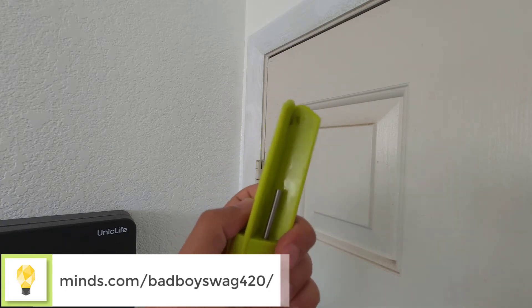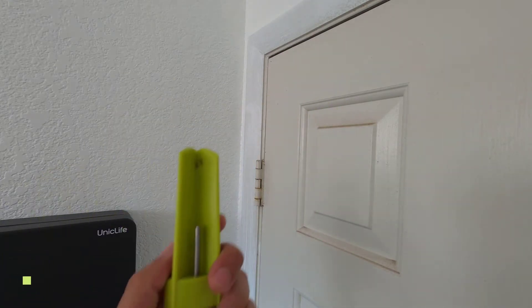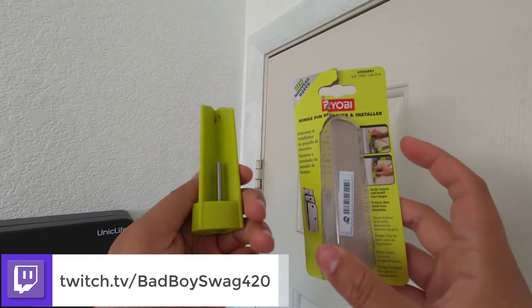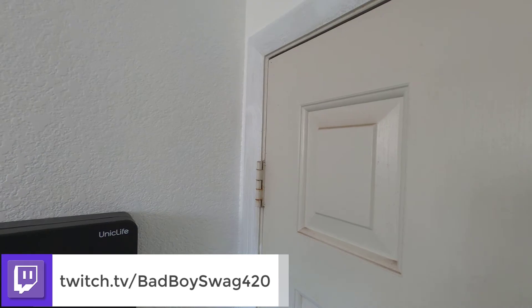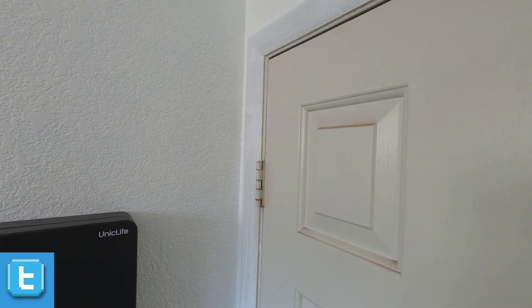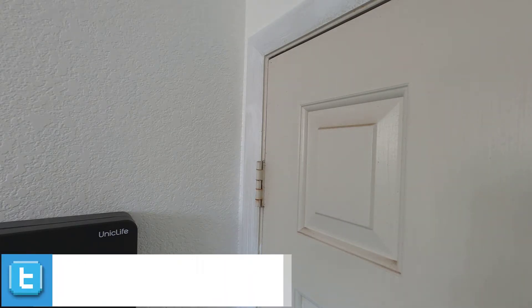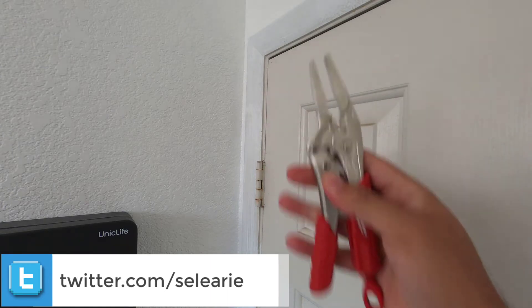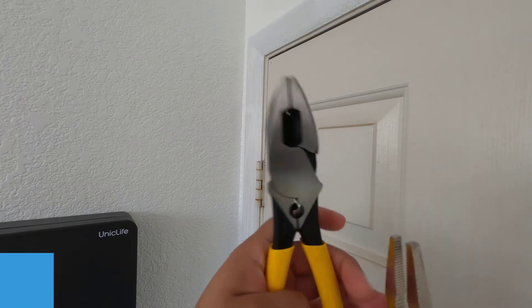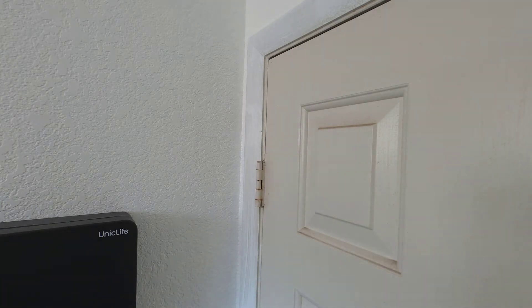I've tried all sorts of ways to remove pins — this is the best way. This is literally all you get. You're also going to need a few tools: a smooth-faced hammer — it's got to be smooth-faced, don't get something texturized — and a vice grip or lineman pliers. I'm going to try the lineman pliers because I haven't tried that before.